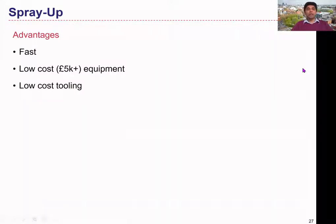Looking at the advantages and disadvantages of the spray-up process, one possible advantage is that this process could be relatively faster — we just use the spray gun to spray the reinforcement and matrix materials onto the mold surface compared to the manual layup process. However, you have to understand that here we manufacture very large components, so it still takes some time — maybe more than a day. The initial capital for this process could be relatively low, but it could be higher than the manual layup process since we have to purchase a special type of spray gun.